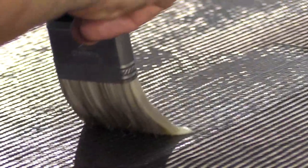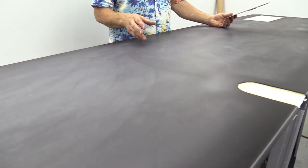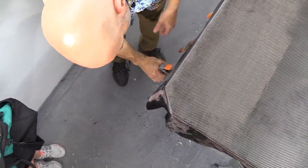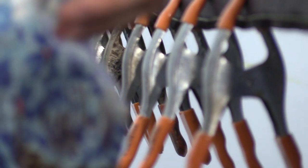The problem I had was I thought the layout came out relatively well, but with carbon fiber you want to lay it up really dry for your first layout, and that's what we're going to do today. We want all our lines to go straight — extra attention on that today — and we're going to be using spring clamps to hold the excess down over the side so it won't move while we're laying it up.